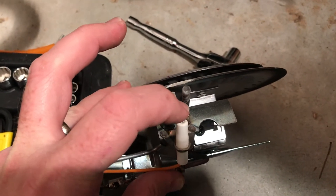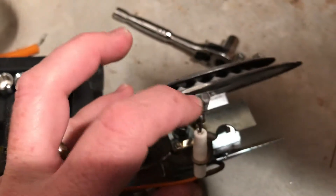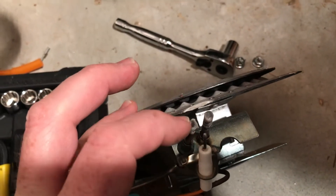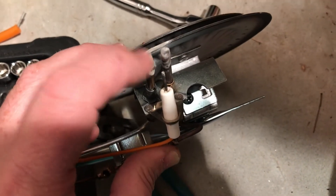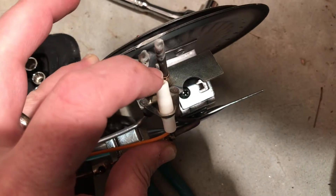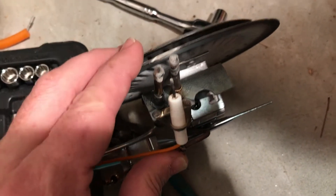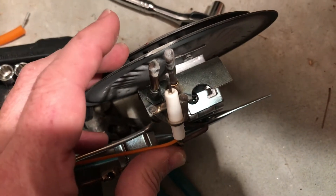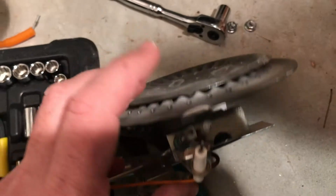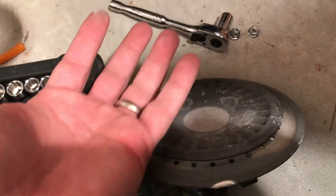This is your sparking mechanism. If you push the button up on top, it sends a spark to this piece, which lights the pilot. As you hold down the pilot lighting button, it will put gas through this tube. You hit the sparker to send the spark, hold it down for a bit to heat up the thermocouple, and then once you let it go, it should stay lit. Then once you turn it to the on position, it will light the burner and you'll have flame that comes out all the way around, and that's what heats your water.